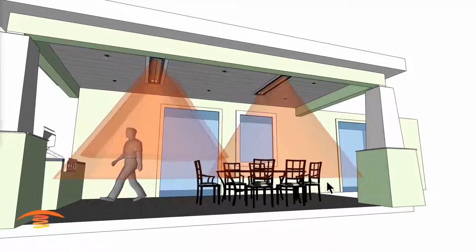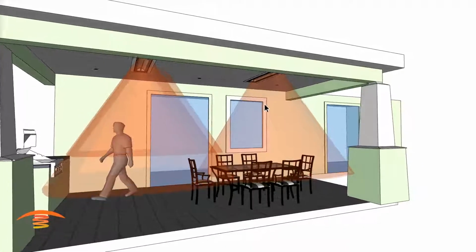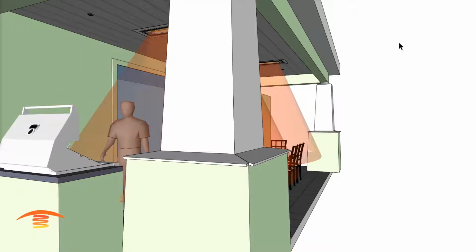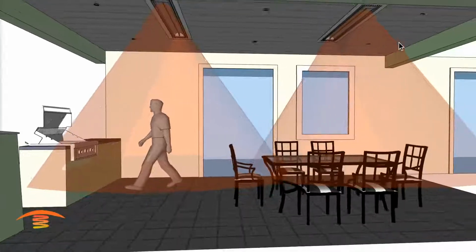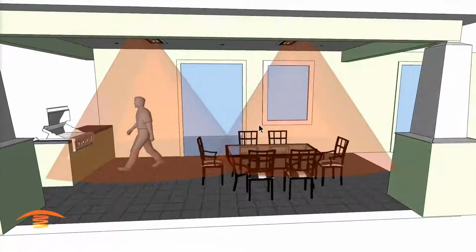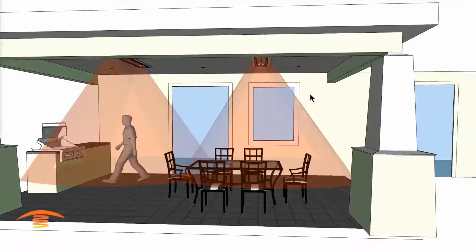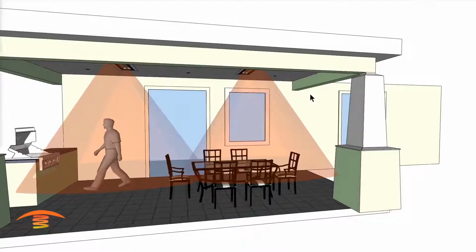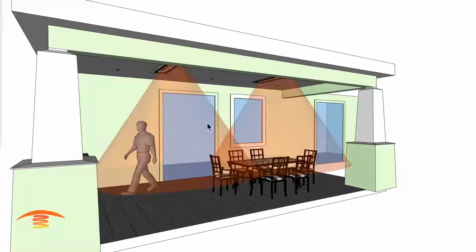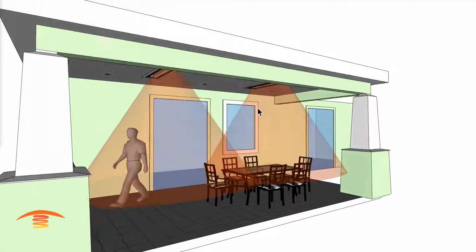You can see that the footprint of heat is raised another roughly 9.5 inches. So the intensity is just about at its peak threshold. Let's get rid of that real quick. There we go. Sorry. This is 4,000 watt, and again, 6,000 watt would probably be my preference on an application like this. But a 4,000 watt will give you a pretty good amount of heat during cooler climates. I wouldn't go to the real cold climates. If you were getting below the 50s, maybe even the upper mid 40s, maybe a 4,000 wouldn't be hot enough, but 6,000 definitely would be nice in this application.